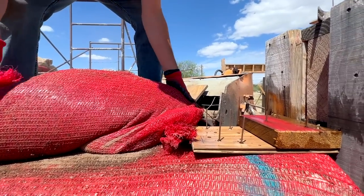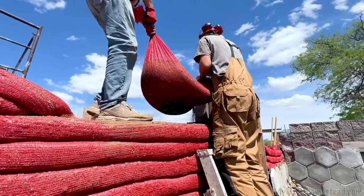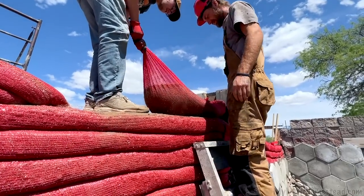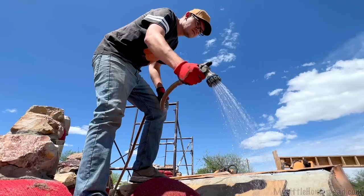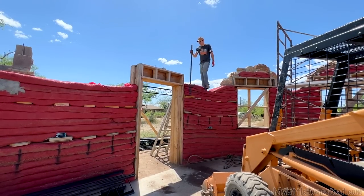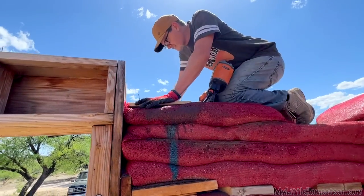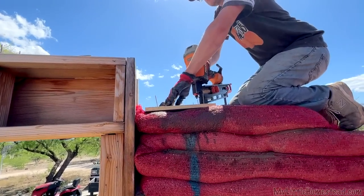We had two options we began with. The first one was I was going to attach the truss beams to the wall. Secondly, it kind of came to me when we started to get to the processes, why don't I use the same cleating process that we've been using all along? So we just drilled some holes and attach some plywood and nails and screws, and just attach them like we normally would a cleat, and hold them to the posts.